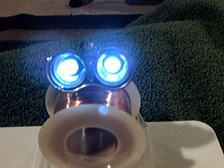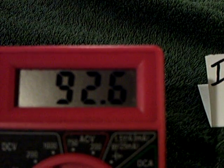You have to hand start these; unfortunately they don't self-start. Okay, there it goes. There's your flyback. There's my little magnet junkie Maggie with her little neodymium ball spinning up, and there's the motor running away. Now I'm going to connect the capacitor to the diode that captures the flyback, which is that right there. Watch this cap climb. This is DC voltage - 92 volts on that capacitor right there. And that's what's coming off of the flyback on that little motor.